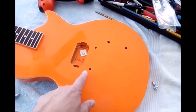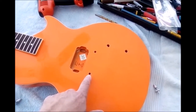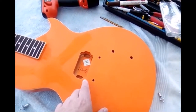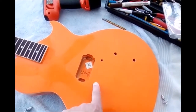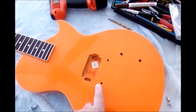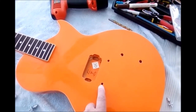That means we have to drill the hole wider. To do that you start with a drill bit that is just a tiny bit larger than the hole that's already there, and you go back and see if your anchor is going to fit. If it doesn't, go to the next size drill bit — do it very incrementally, step by step. You also want to tape the hole off and press the tape in, punch a hole through the tape. The tape keeps the drill from lifting up and chipping the veneer or finish.